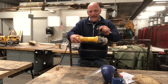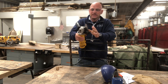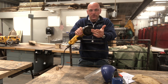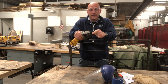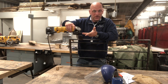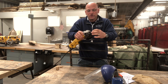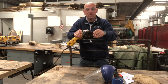Alright friends, so this is an angle grinder. It grinds with a disc. You can get different numbers and types of discs. This one is a grinding disc — it has the grinding surface here flat. It is not a cutting disc. They do make cutting discs; those are very thin and meant to cut on the edge. This is a grinding disc, meant to grind on the flat part. You don't want to interchange them — don't use a grinding disc for a cutoff operation because you can break these. If there's a chunk out of this, it can become very dangerous and could actually break apart and send pieces flying.